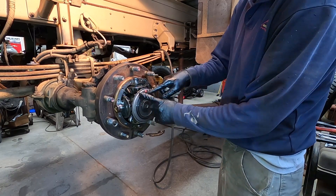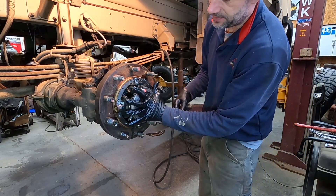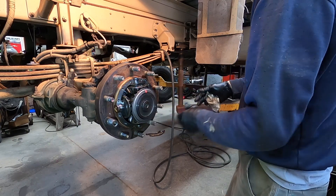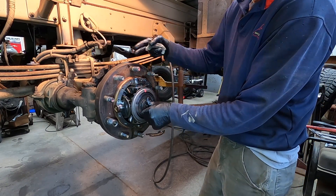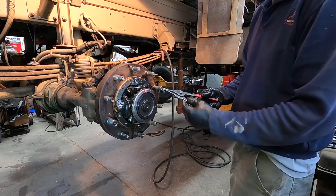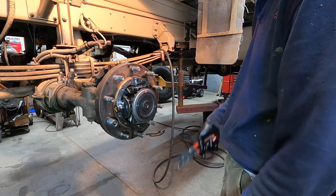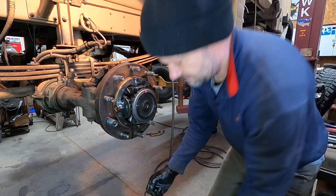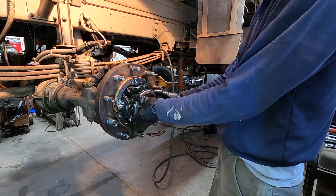There's another gear just like this one in the back, and behind that gear there's some shims, so the cover goes up against this one. You shim it behind this back gear so when the cover is on, you have the proper clearance on these gears. I'm going to take this snap ring — want it right in the bucket of oil — and take that snap ring off the end of the axle and slide this gear off.